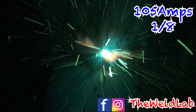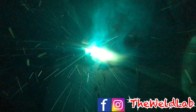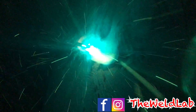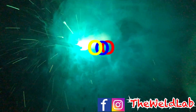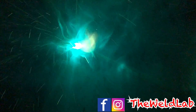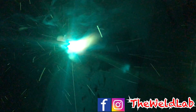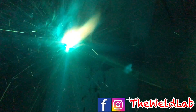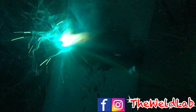I started doing my hot pass. I like to run my hot pass at 105 amps. A good method is to do O's overlapping each other, kind of like the Audi symbol. Make sure to hit the top and the bottom wall. I like to pause at the top wall for about a second, and whenever I come down I just come straight up — I don't pause at the bottom because you are playing with gravity since you are at 45 degrees.